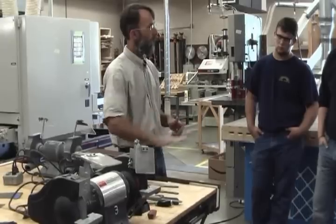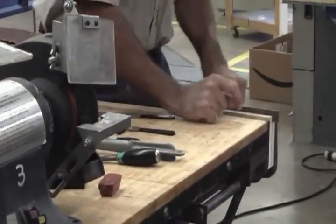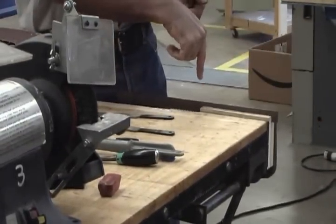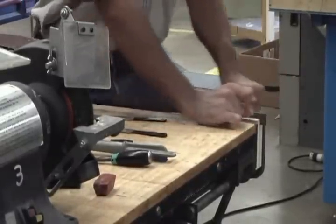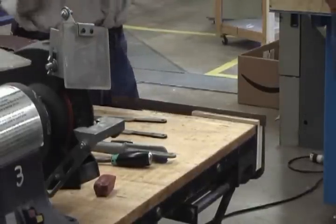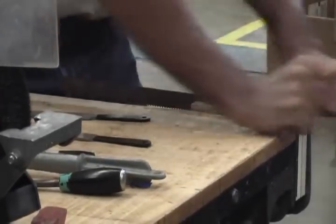We're going to work that metal with a harder piece of metal to smooth it out, because there are file marks down there, bordering on microscopic, but they're there. So we're going to work that down. We're taking metal at the microscopic level and pushing it down. Right now my burnisher is just 90 degrees to the blade.